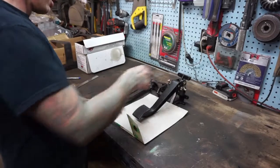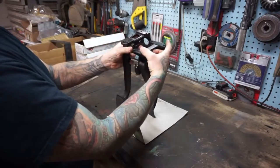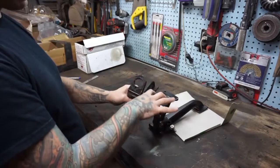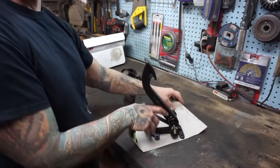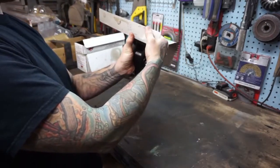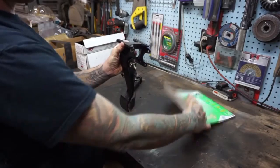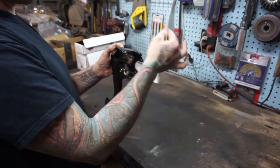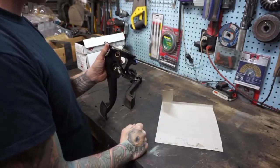So I have to make a plate to go from here. They're sitting in the car like this — the plate's going to tie in the top of this to the top of this, and then bars that come towards the firewall. I know that from the center of this to the center of this is three and three-quarter inches, so that's where I'm going to start. I'm using this particular piece because it bends up right here. There's going to be tabs triangulated, and that's what the support bar is going to hook to. You'll cut a kerf into it, bend it up, and it'll be one piece instead of cutting four different pieces. You'll be able to bend it, get all your angles the way you want them, and set this thing in place.